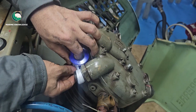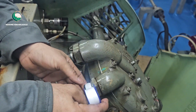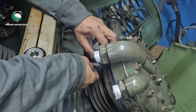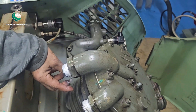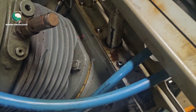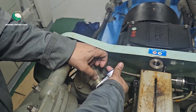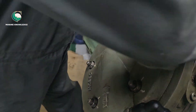When doing these changes, the main thing to keep in mind is to always make sure you are not damaging the thread during installation or removal. Use proper tools and try to avoid using adjustable spanners. If you feel there is any over-tightening or over-resistance, stop and ask for help — because if you keep tightening too hard, you are damaging the thread. That is a warning sign. All these things are very important to keep in mind while renewing the high pressure pipe.